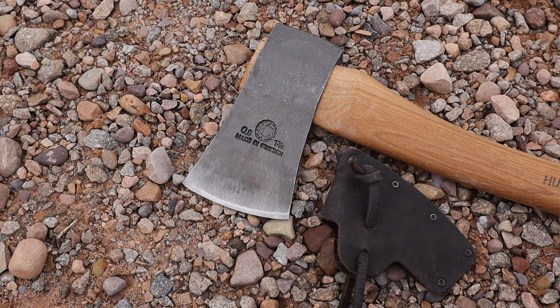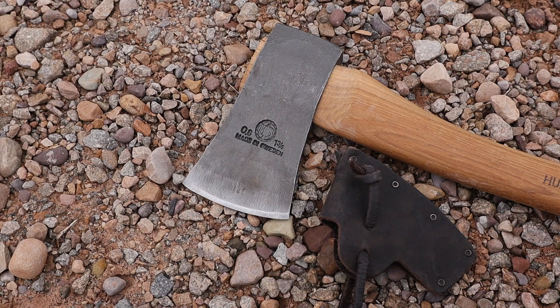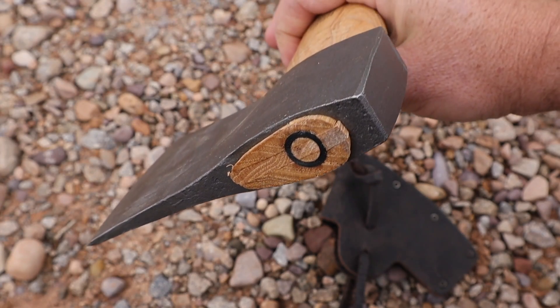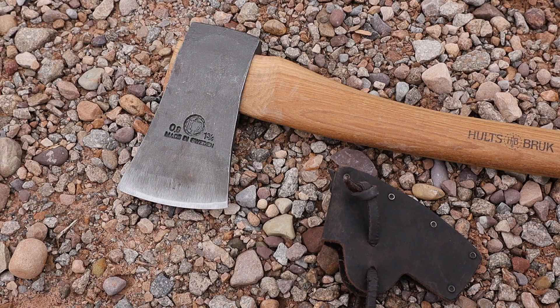Let's jump into the head. I'm at a campground in Moab, Utah — bounced out of the woods and into the desert for a while, but we can still talk about how this hatchet performs. The cutting edge is three and a quarter inches. Overall length from edge to back of the poll is six inches. Maximum thickness is one inch, tapering really well just how you'd want it to. It splits exactly as it's supposed to.